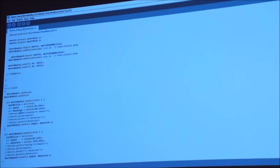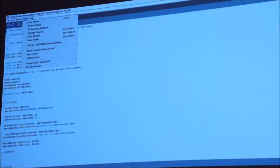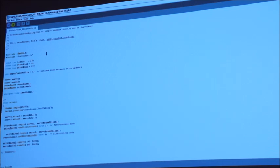And then what it's doing here is moving those 2 servos to random places independently, between 30 and 150 degrees, which is the angle I've used for the head to go this way, and between 60 and 120 degrees, which is the angle I've used for the head this way. So this is just controlling 2 independent servos. I've got these already connected to pins 9 and 10, I think. So in theory, if I click on sketch and upload, we'll see how that servo easing works on these.